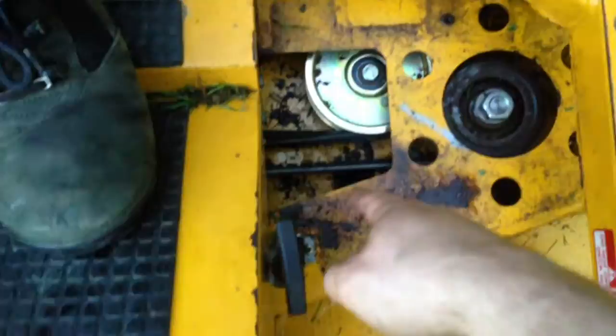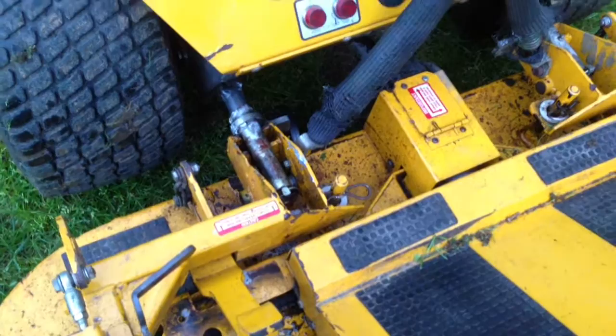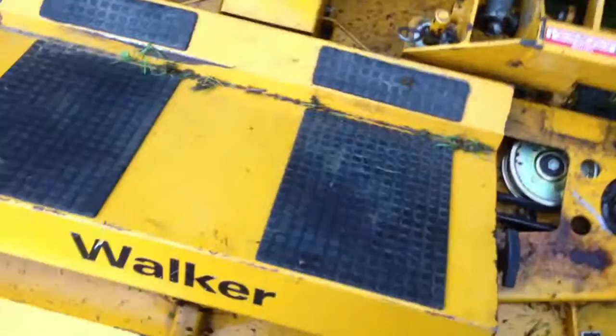This got welded — had to weld this piece here. It's got 764 hours. That was seized on. I actually got to put the grease fitting back on there, but had to take it off — smash it with a hammer and stuff — and then put never-seize all over it. Did that to the other side as well. Put a new pulley under this and had to grease everything under there.